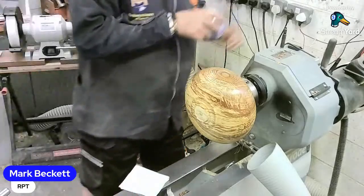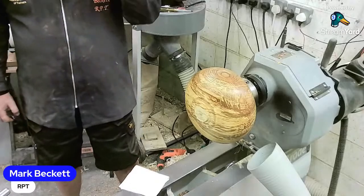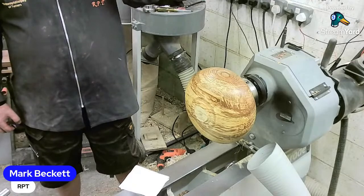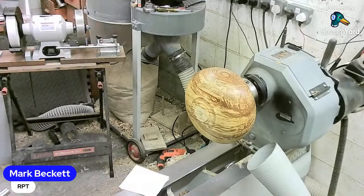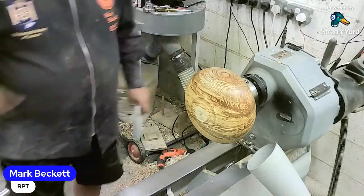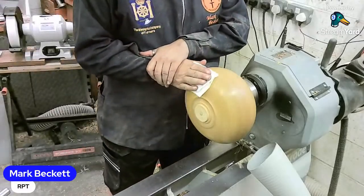This is the thing that I like, and not a lot of people know this, or have taken notice of people that do this. You can put a wax onto a piece of wood, usually a softer wax, the likes of the Hampshire Sheen High Gloss, the Hampshire Sheen Original, Chestnut Products Wood Wax 22. You can put them on as a base coat onto a piece, and then put the microcrystalline wax on as a finishing coat over the top of it. And it works absolutely brilliant.